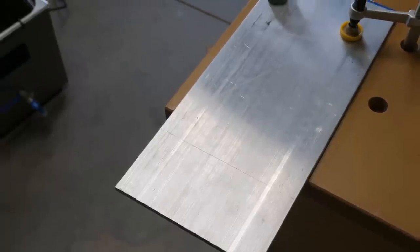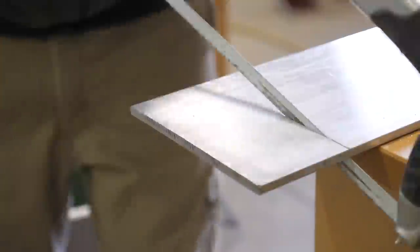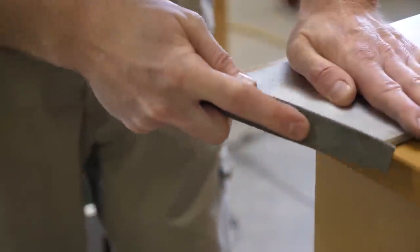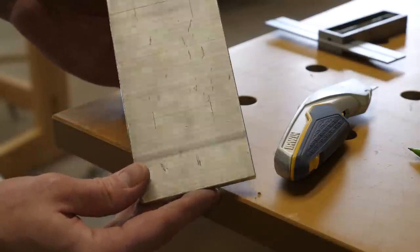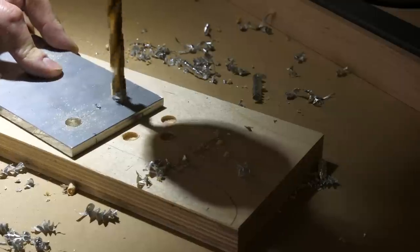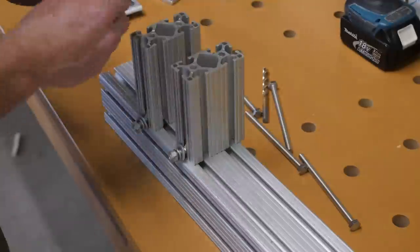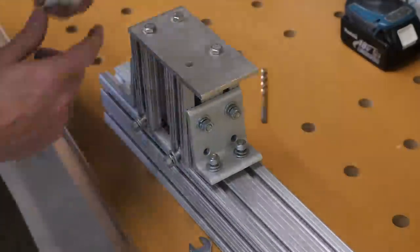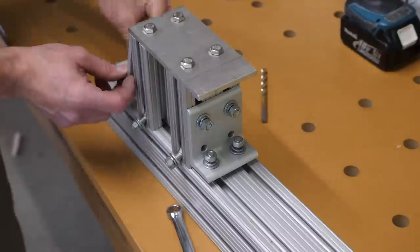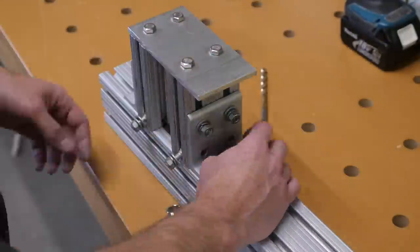I wanted to add a piece of aluminum to the top of the clamp and move the pneumatic hookup to that piece. The reason is the stock location comes out of the back of the machine, so the machine can't be pushed up against the wall, which is not good. I used my two-horsepower hacksaw to cut out the piece, then marked and drilled the needed holes. Here's a look at how the clamp and rear fence come together — it's just a bunch of aluminum extrusions bolted together. Simple but effective and fully adjustable, which is neat.